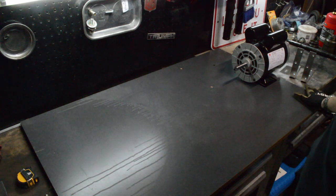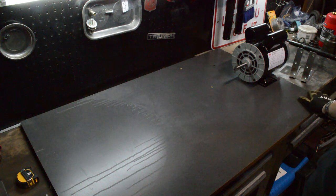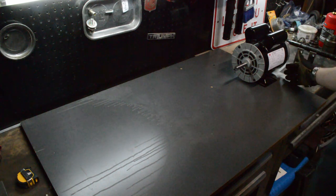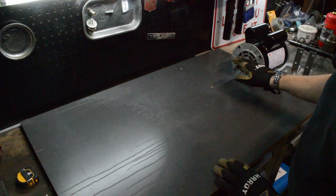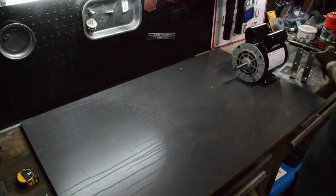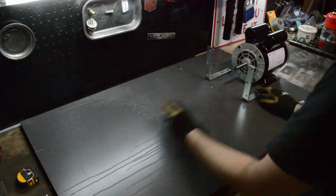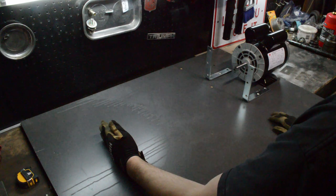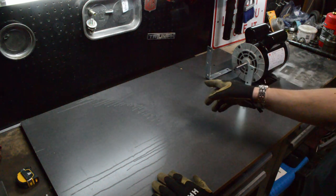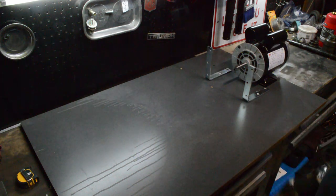First thing you're going to want to do is lay everything out. This board is left over from a desk I threw out. It's about 40 inches long. You really only need about 36 for the Spitfire gearbox. If you're dealing with TR6 stuff, at least 40 inches, probably closer to 43 or 44 — something like that will be more than enough room. Remember you can have pieces hanging off the edge too. You also want it to be wide enough because as the motor turns on and you spin up your transmission, it introduces some torque and you don't want anything to roll off. My plan is to build a base so I can raise and lower it, have the gearbox bolted on the front, and have a piece at the back — just a two by four bolted down to the board — to hold it up. We can connect the motor to the gearbox with a piece of rubber hose. Just make sure you clamp it down and have an appropriate size.